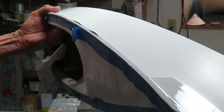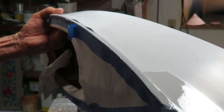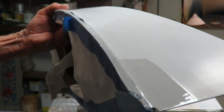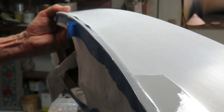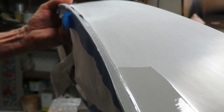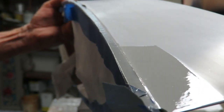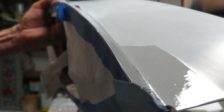That really is why wet sanding is such a nice technique, because you're blending, you can recoat, you can sand out any blemishes. You have all sorts of options. It's not like, if I'd had to get a perfect finish over the whole boat because I had a little flaw, that would be a lot more work and a lot harder. You might have a flaw someplace else all of a sudden, a run or a sag. So that's why wet sanding is such a good technique.